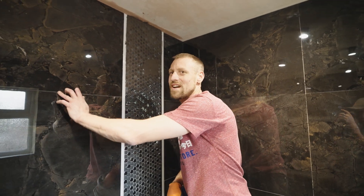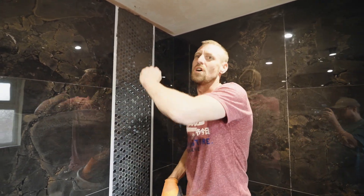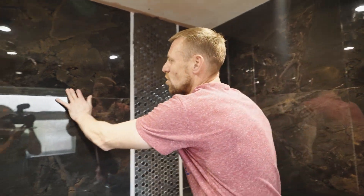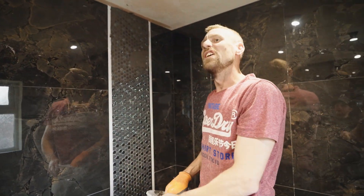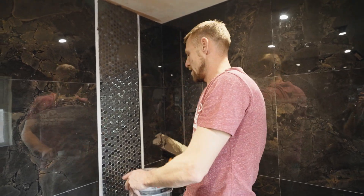With shiny tiles, your grout sometimes tends to sink. So always put one coat in and then sometimes put another layer in just in case it sinks — wait for that first coat to dry because the tiles are so shiny. If it sinks in places, wait for it to dry and then go again. This mainly happens with big shiny tiles.